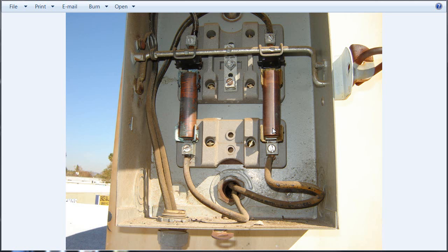One of the other things is this particular air conditioner has a max fuse size of 80 amps. Right off the bat this whole thing only has number eights going to it, feeding it off a 50 amp breaker. The nameplate on it was so deteriorated that I couldn't really read what the minimum was, but we need to go off the max fuse size.